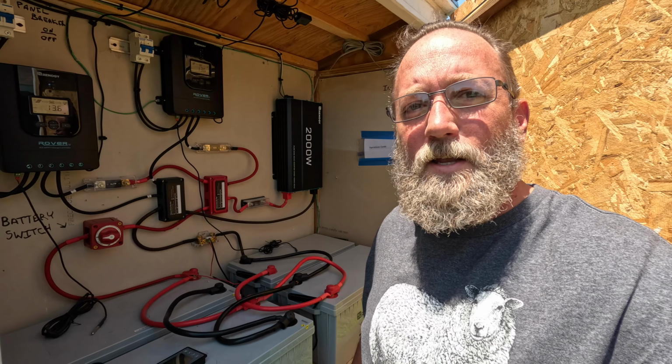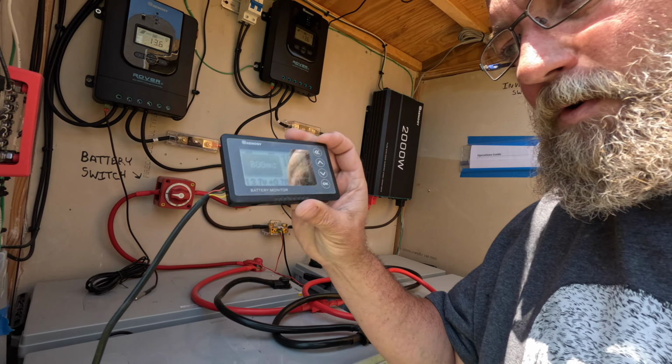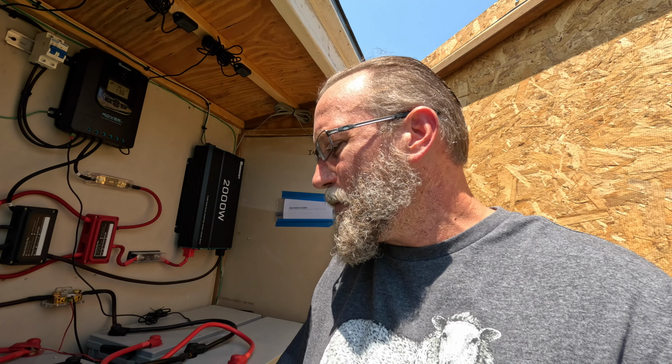All right, so we're outside at the battery backup bank, and you can see it's at 100% right now. If we can get that up to the camera, 800 amp hours, 13.7 volts. Honestly, I'm not expecting this to really dent my backup power at all, especially with the panels going. The sun is up, it's a nice warm day. We're about plus 7 amps because everything's at 100%. But we wanted to check it out, and we'll come back out at the end and see where we're at.